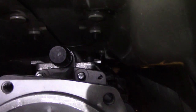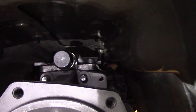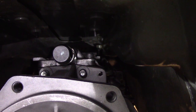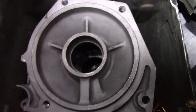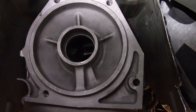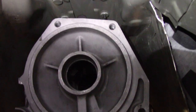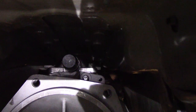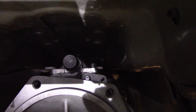All that work was done just for this. Basically, now the remote shifter adapter on the top of the transmission is horizontal, lined up with the body. You can see how the C5 Corvette tail housing is now clocked even more clockwise to the right, and I'm going to build that into the adapter. This should make the remote shifter system line up with the car a lot better. It was a lot of work to modify the bell housing, but it was the right decision.